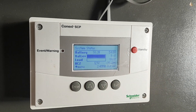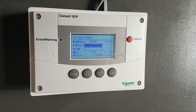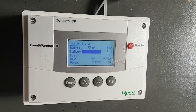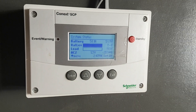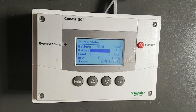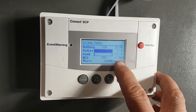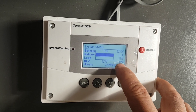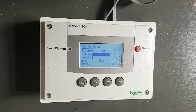So 54.8 — it's coming up. If this was a lithium battery, it would take a long time. Lithium are so strong and they charge so nicely. 54.9, we're getting ready. There we go — 55 volts. It's going to hold there just for a bit. The generator went into cool-down mode. It did reach 55 volts charging. It's in cool-down mode — it'll run for 30 seconds just to cool the engine down and then shut off.